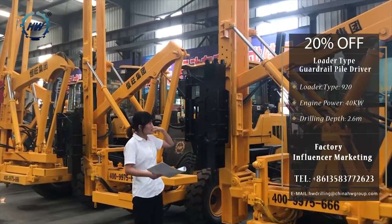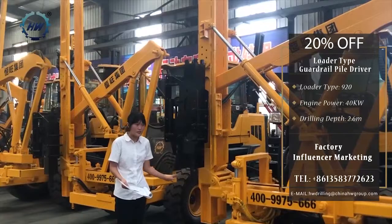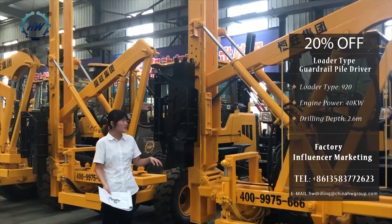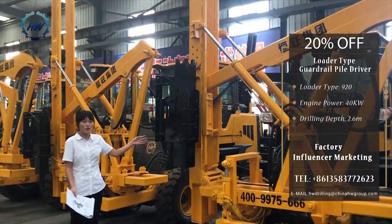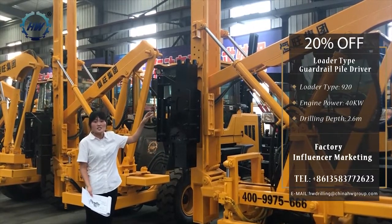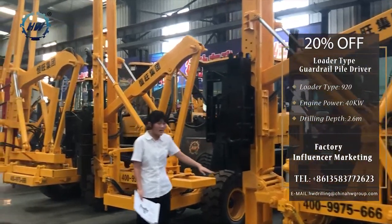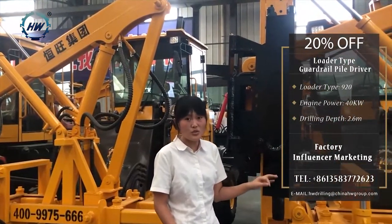The hydraulic hammer will be equipped with a power cap. Under this, your post can be up to 3.3 meters. Our slide height is 4.2 meter. But the effective piling height is just 3.3 meter, because this hydraulic hammer also has some size in here. You can see. So the most height of your post can be up to 3.3 meters.